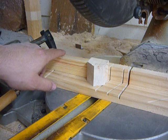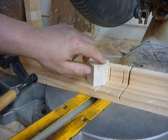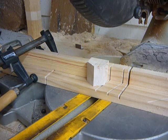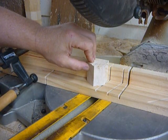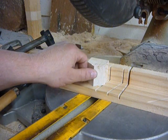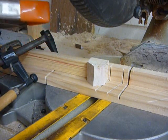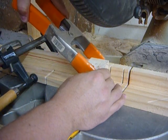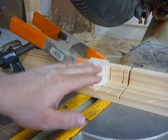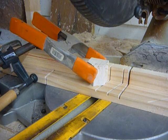Don't think you can set the stop block and have every piece come out the same. Because we had to sand these faces independently, that's going to throw things off a little bit, so make sure you adjust your stop block for each piece. Now as far as holding the piece, it's actually very tricky. You might want to hold it with your fingers, but you're going to be pretty close to that blade. You could rig up some kind of stick to hold it in place, or even a toggle clamp. But the simplest solution I've found is actually just a large spring clamp. With that holding it in place, I can see my blade is still going to clear it and it's holding the piece very securely. So with that clamped in place, we're ready to make a cut.